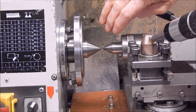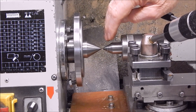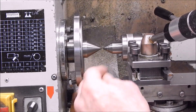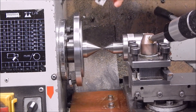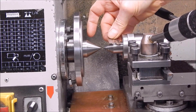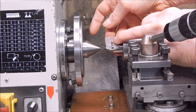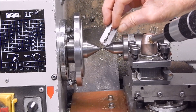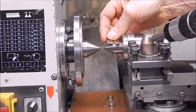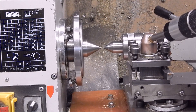This is the same technique you use to find the center point on a curved surface. If you ever want to drill into a piece of curved pipe, you put a razor blade on it and bring your drill tip down onto it — unless you're dead center, it will push the blade one way or the other on the curvature. You don't have to use a razor blade; you can use a packing shim or anything flat. That's a good way to find top dead center on a curved surface.